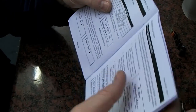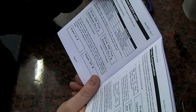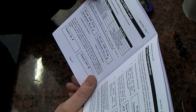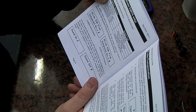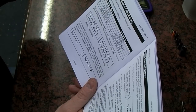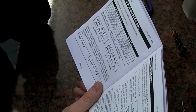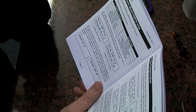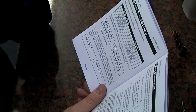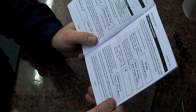There are audible alerts on the ESR70 model. Start analysis is a short blip, end analysis is a short blip. If the measured ESR is greater than 40 ohms you'll get a high-low beep. A measured ESR below 5 ohms gives a single bell ping, and an ESR of less than 1 ohm gives a double bell ping-ping. The audible alerts can be turned off as demonstrated, and probe compensation is important as we've shown.